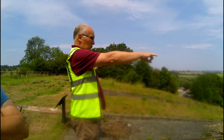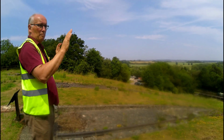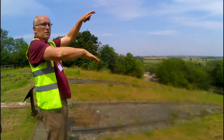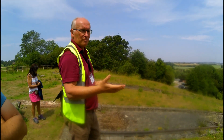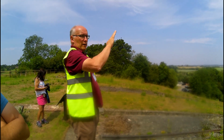When they're in the middle journey, when they're on the slope halfway down, they're pretty well balanced. They're working like a funicular railway, going up and down your cliff. Once they're in balance, they will move without any extra power essentially. It may need a little bit because of friction, but not a lot. So essentially this is a free moving balanced pair going up and down the slope.